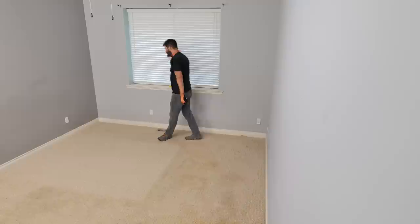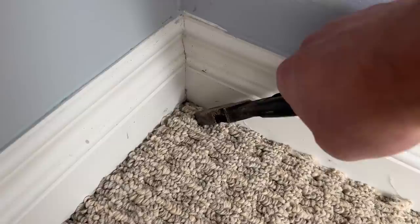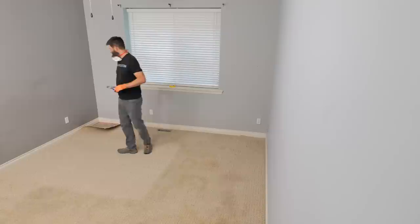Because I like to cut this into strips, you just want to check to see what is underneath the carpet before you start slashing. Go ahead, take the pliers, grab one of the corners, and just pull it up and have a little check. Underneath this carpet we just have plywood, so we can cut through the carpet, through the underlay, right into that plywood and not have to worry about damaging anything. Let's go ahead and make that first cut about three to four feet off the wall.